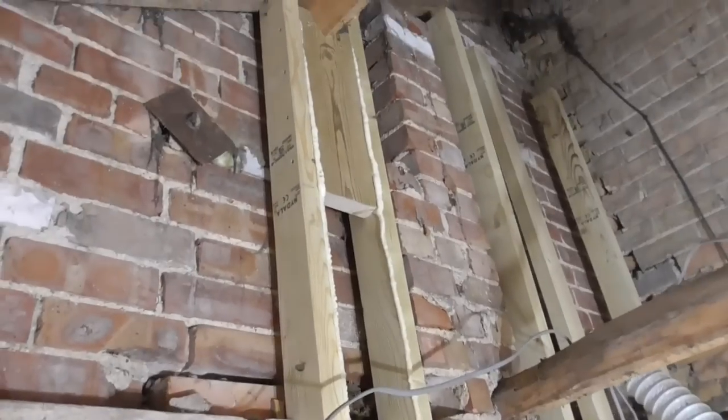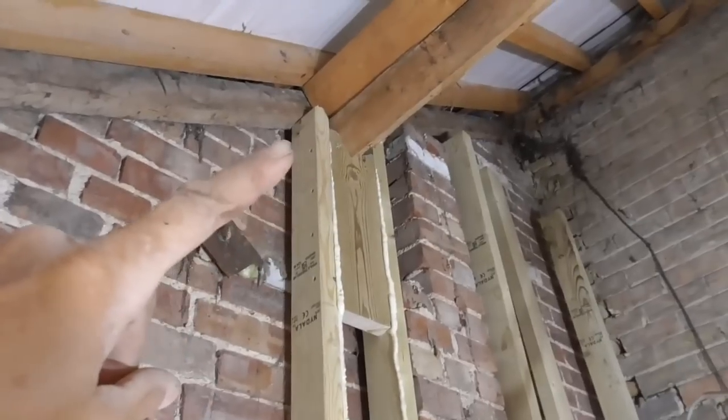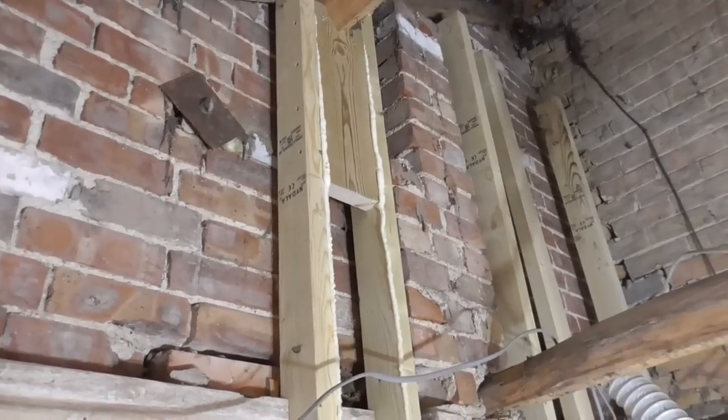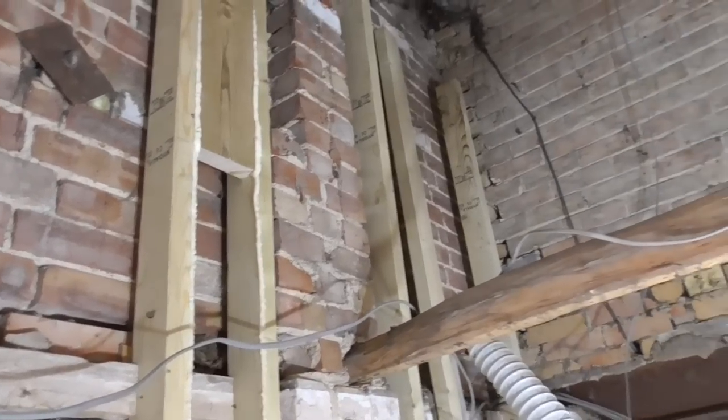Because again, not traditionally, I should say, if this was a newer property, obviously there'd be gable straps going out onto here. It's not going to go anywhere now. It's been like it for years, as I said earlier, but we've got an opportunity to put a few extra ties in there. I think it'd be silly not to take the opportunity.